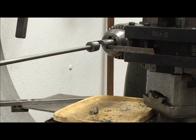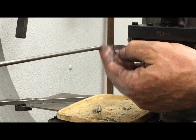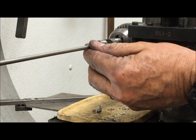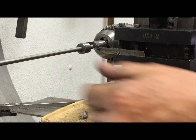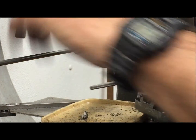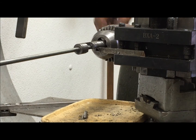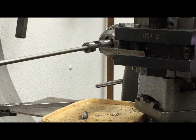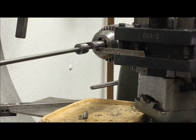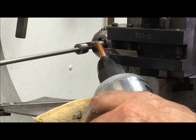I'll explain how to make it in the article. I've already cut a few — there's the point on there — and I push that in until I see the point in this little cross-drilled hole down here, and I lock it. I'll do it while it's running — that's the whole point of this. I lock the tailstock, a little bit of cutting oil.